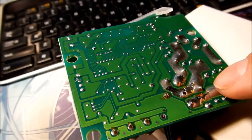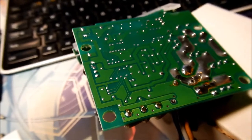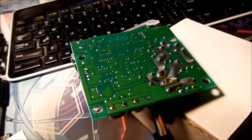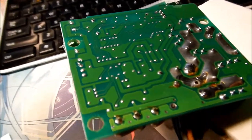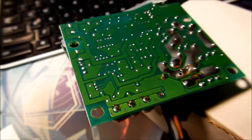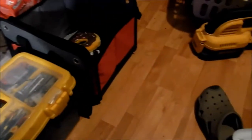Another reason it came off is that it's not soldered properly. See how all the other wires have wire sticking through the hole before they soldered it — on this one the wire isn't sticking through, it's just kind of touching it. The tip looked pretty clean to me, so what I'm going to do is desolder it. Here's my soldering iron — this is a heavy-duty one. Hopefully we won't burn anything too bad.